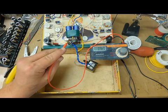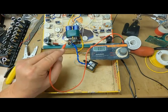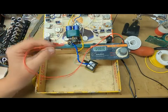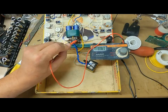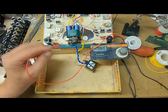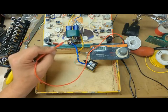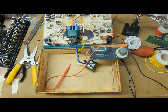If we check, this is the fully rectified. If I check off this first capacitor, now I have this going through a 22 ohm, like a half watt carbon resistor, and that's going into a 220 microfarad 160 volt electrolytic. That's coming out to be 3.6 millivolts. Something's not quite right. Aha! I don't have the ground hooked up from my full wave rectifier, but I do have the positive attached. Alright, I need to remedy that, then we'll come back and check.